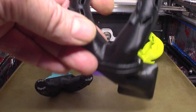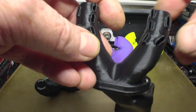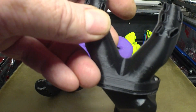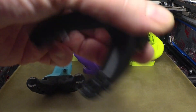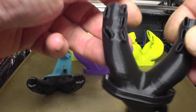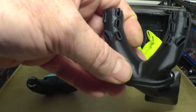After this duct I tried to make one for the 4028, adding two ports on the side, but they're just too big. I did not simulate this when I made it — had I done that, I would have reduced the sizes to get the air out better. There are too many orifices here for a 4028 and it just starves that fan. This 4028 duct has a pretty large hole and large back end, but that 4028 just won't work unless it has a large feed down to the duct. These are just 90-degree holes from the air path, and you'd think that would be bad since air has density and mass and wants to follow the path of least resistance.